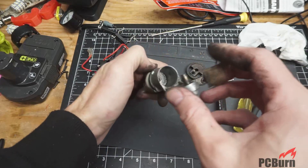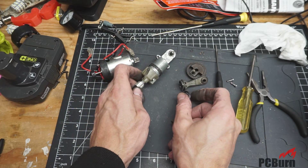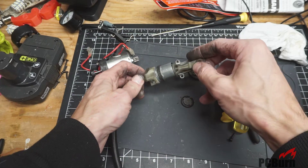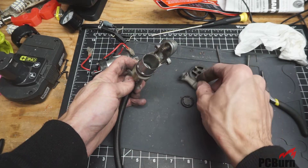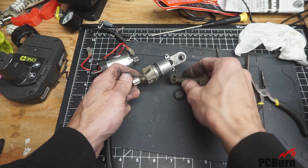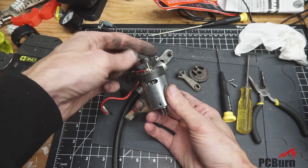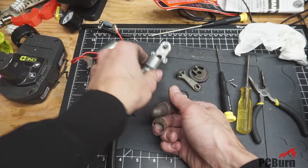There's the check valve and the opening at the end to keep air from flowing back in and let you push the air out that way. And that's how it works. This piston goes back and forth. On one stroke it pushes the air through that ball bearing there, opening the valve essentially, pushing the air through this way. Then on the return stroke it pulls back, the ball bearing closes — or a flap of some kind, but it looks like a bearing — and it pulls in air from the rest of it with this valve here. Then on the next stroke it pushes it through again. Repeats quite a few times. This is probably the biggest problem with it: the fan blew itself apart and stopped cooling off the motor. The motor starts overheating and the whole thing stops working efficiently because it generated way too much heat.